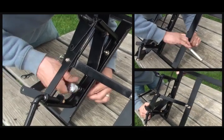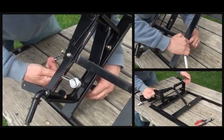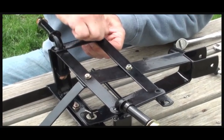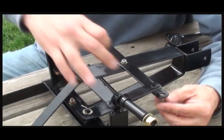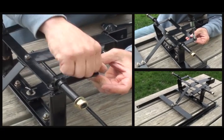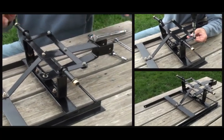Return to fully tighten the axle and axle brace mounting holes. The bolts should be snug. Now take the tie bar, position the ends under the axle ends, align the bolt holes, and install three shoulder bolts, flat washers, and lock nuts. Tighten the bolts until snug. To prevent stripping of the threads, do not over-tighten.